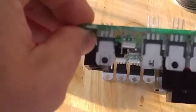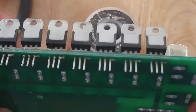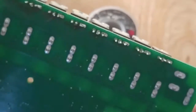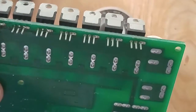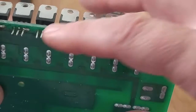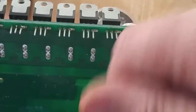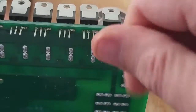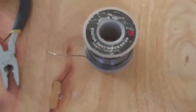I'll be back in just a second. I've gotten all these holes cleaned out, I've got the ICs in, and I haven't soldered them yet. I'm going to solder them, and once I get them all soldered in, I'm going to cut these legs off so they're all nice and short. Use a toothpick — spin it as you get it in the hole and keep spinning it, let the solder cool, and that'll keep the hole open. Then you pull your toothpick out.